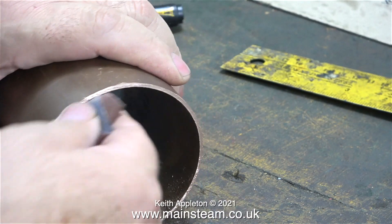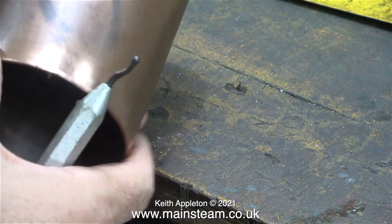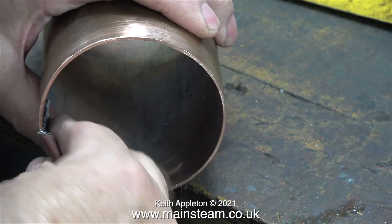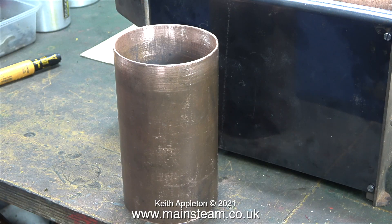After which I used some sandpaper to remove the sharp edge, but this tool is much better. It's called a deburring tool, and I bought this one from Black Gates Engineering about 38 years ago. Time really flies when you're having fun. In this clip you can see how the deburring tool works. It's great for this job and it's very good for deburring drilled holes. I'm finishing off the inside with some emery cloth. Now this tube is squared at both ends, it sits perfectly vertically on the bench and it's more or less in scale with the 504 boiler.